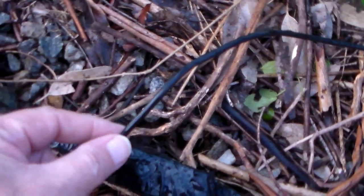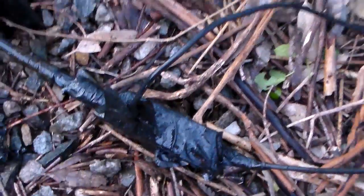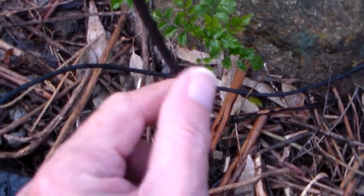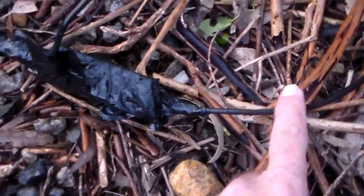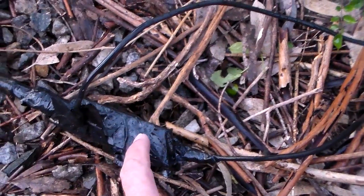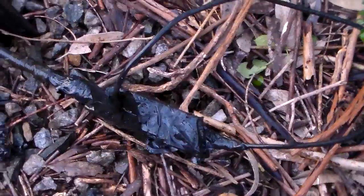This is the ground wire, goes off to a couple of earth stakes. That's a banana plug that goes in there — it's not very nicely wrapped in PVC insulating tape, just well enough to keep the weather out of it. And this is the copper wire that goes up, the one that's swaged onto the steel wire, and that comes down here as another banana plug, and that plugs in there. This is a Tet Emtron selectable un-un — it does 4 to 1, 9 to 1, and 16 to 1.